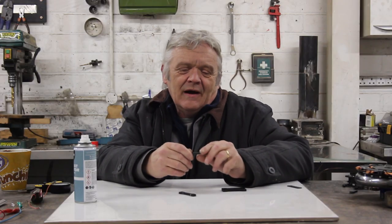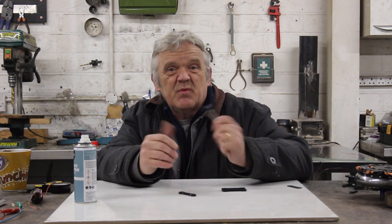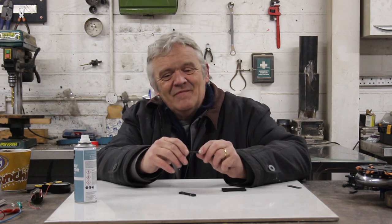We can bend it but we're not breaking that any time soon — that's kind of cool. Now I have been suggested to put them in the oven and give a bit of heat to get them to fuse together. To be honest, that's a terrible idea — you can't control the heat in an oven. What will happen is your plastic parts will warp and you'll end up with bits dropping off and bits twisted. Don't do that; it's a waste of time.